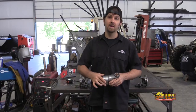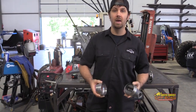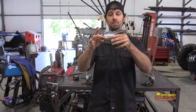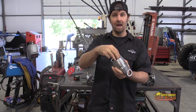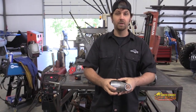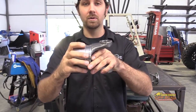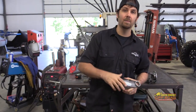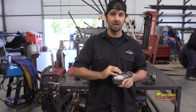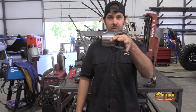In our 1480 kits it comes with an adapter and a 3 and 1/2 inch forged weld yoke. They're designed to press together and then go on the outside of a piece of 2 and 1/2 inch diameter tubing. We'll press them together — you can see they've got a little bevel on either side. I like to put a little more bevel on them so when I'm running my TIG welder I've got a nice root pass and then a nice cap pass. We'll press these together and leave about 1/8 of an inch between the two.